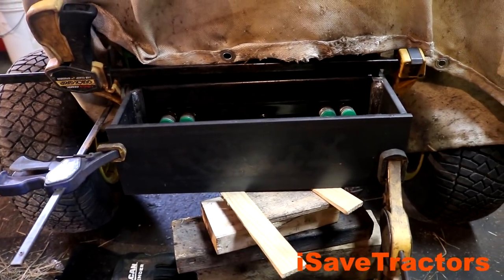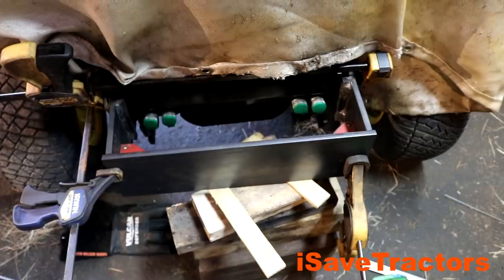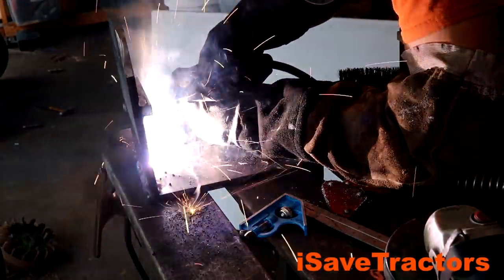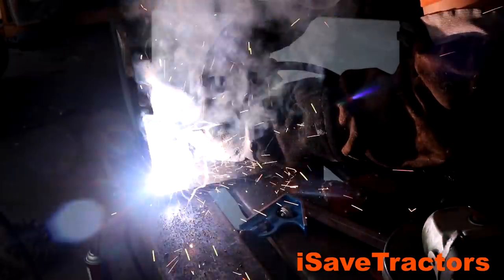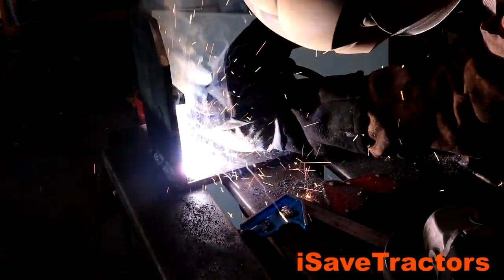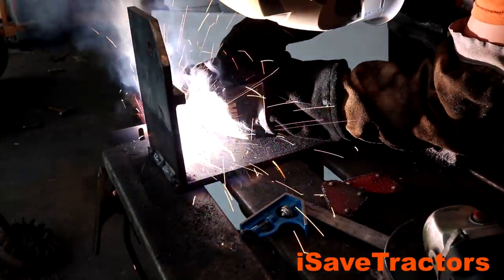Here I am lining up the rest of the bracket. Now that everything's aligned, let's just get right to the welding. This new welder I'm using puts out a tremendous amount of heat given its weight and size. I am welding the support brackets with three passes using flux core wire, and as you'll see in a moment the welds came out great. This is a very strong bracket, and I'm going to be hanging about 240 pounds of suitcase weights onto it.